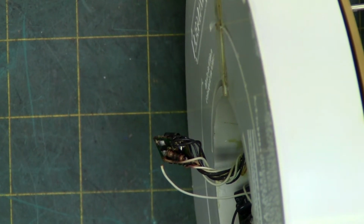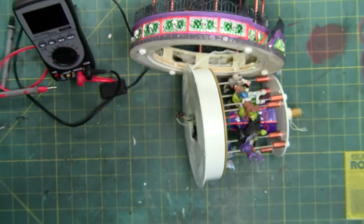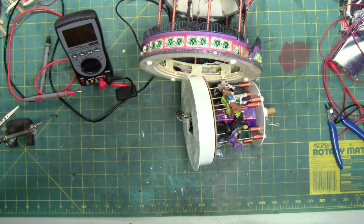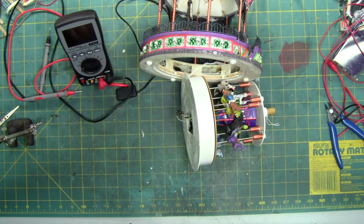So I'm going to get a piece of paper and do some testing with the meter and figure out what the resistances should be based on the color bands that I can read, and then try and figure out what the one resistor does that has no color bands left. Do some tracing of the tracks. That's basically where you take the circuit board and you trace the tracks and see where it goes. And then I'll probably have to look up the chip to find the chip's pinouts.